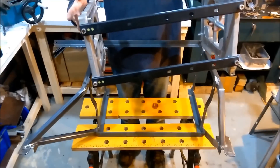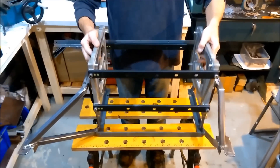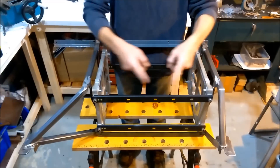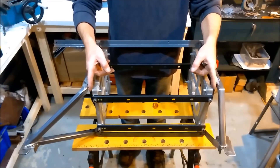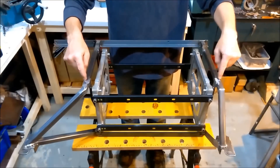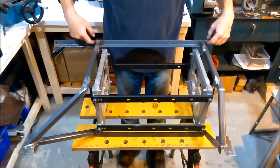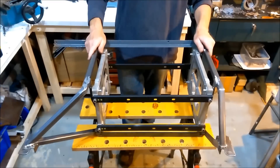I've shortened it down to a pack of 12 as described earlier, just by cutting those. It drops in there like that, but of course I've got tie rods that tie this pack together when the batteries are actually in place, so I needed to allow room for the threaded rods and the nuts at the end to compress the pack so that this could slide down. I nearly didn't do that and then realized at the end that I needed to, so I put these out and made this a bit wider, which just about picked up on or just about missed these two holes. So that's ready to go in - next thing is to put it in the car.